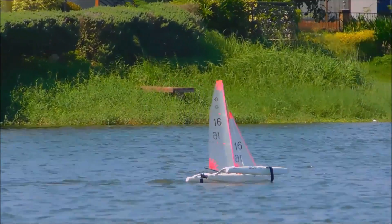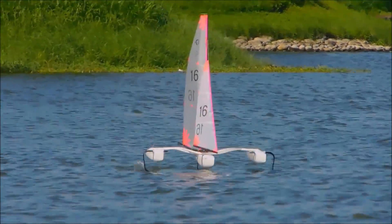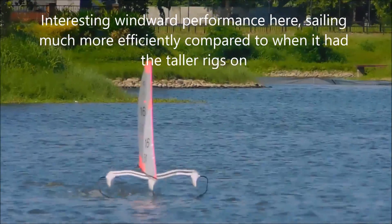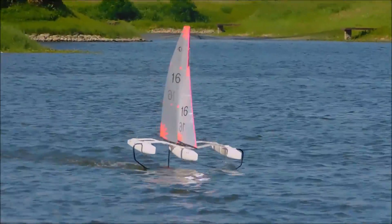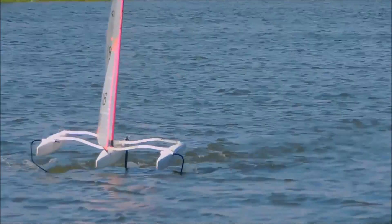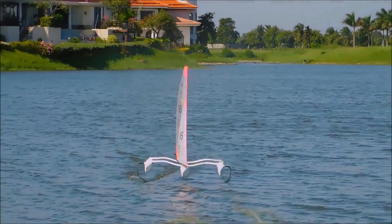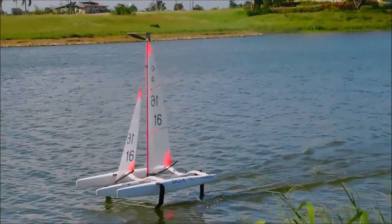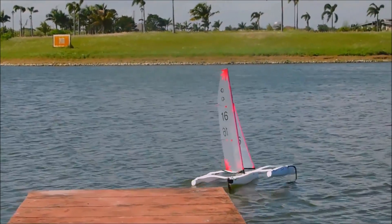So much so that I'm wondering if I might need a smaller rig for really strong days. It is interesting to see the boat foiling on virtually an upwind leg here, and this is very encouraging. I think that the foiling must be happening because the centre of effort of the rig is now so low with the number 4 rig that the heeling moment has reduced to an amount that does not negate the lift from the foils. And this is the best upwind foiling that I have achieved with these boats — so more good news for me.